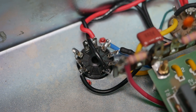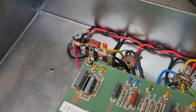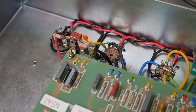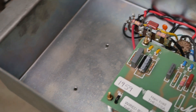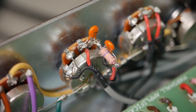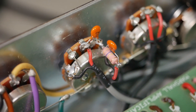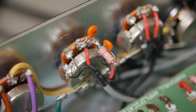To achieve that, I've used one triode out of the extra valve the previous guy installed and just grounded the other one — we didn't need it. To keep the leads short, I've mounted a tag strip on that mounting point there, since we were tapping into both triodes there. That kept lead runs nice and short, as opposed to running everything across to the board over here, which meant everything had to make the trip and risked crosstalk. Here's the 2203 channel input. We've got a bright cap across it too, which in my opinion is a bit too much — if it was mine I'd get rid of it — but I'm waiting for the customer to come and have a listen and make some further decisions, some fine tuning from there.